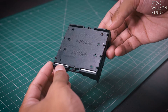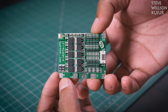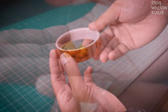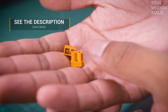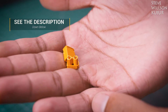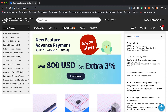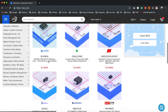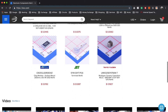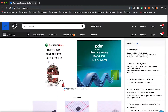The components used include an 18650 battery holder, a 4S BMS — BMS stands for battery management system — some Kapton tape, and a pair of XT30 connectors. I will leave all the part list with purchasing links and Gerber files in the description below. You can go to lcsc.com and order components without any problem. They are the largest electronic parts supplier — ready for shipping takes only 4 hours and they ship worldwide.